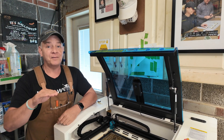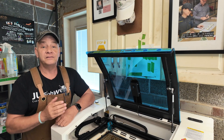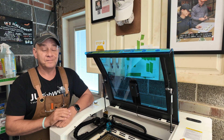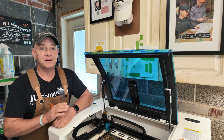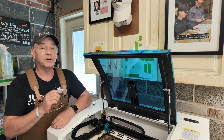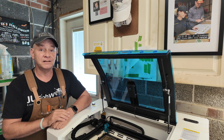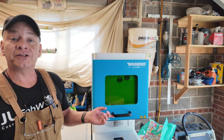I wanted to offer that service when I had my CO2 laser, but it's a magnetic material — not only the top coat, which I believe is a brushed aluminum, but the material for the magnet itself is made of metals, and boy the sparks start flying. I'm not saying you can't do it in your CO2 laser, I'm just suggesting it might not be safe, because those sparks fly when engraving the top, and when you go to cut that magnetic material it gets just as bad, even if you mask the top with paper.